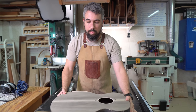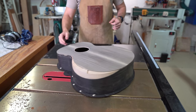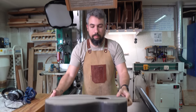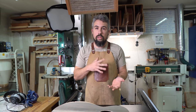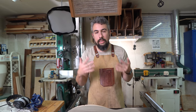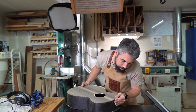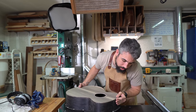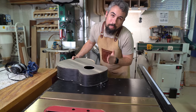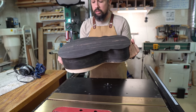Something a little different about this side — you've got to remember there is a bow on the back. We built that into the guitar, so it doesn't necessarily want to sit flat, whereas on the front side it lays pretty parallel. That's the reason why we have binding jigs and all of that stuff to compensate for the back being bowed. What we're doing here doesn't quite need to be perfectly cut, so what's important is keeping the router bit parallel with the sides.